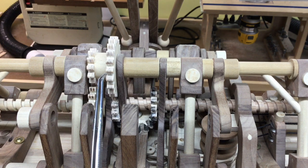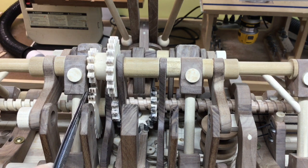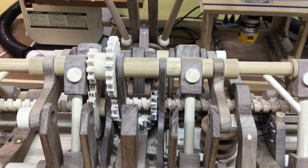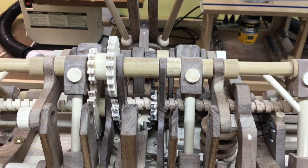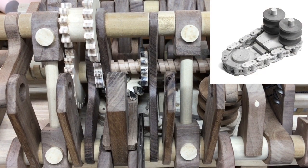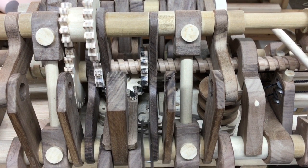This is the gear-down mechanism. When it turns, it gets geared down to here, and then this gear is actually glued to the spiral shaft that controls the moving weight. The cable mechanism is a little harder to see, but if you look carefully you can see this wooden chain right in here. Here's another quick look at that chain installed with it highlighted. This sprocket is connected to the bottom control ring through a series of gears, which then turn this chain.